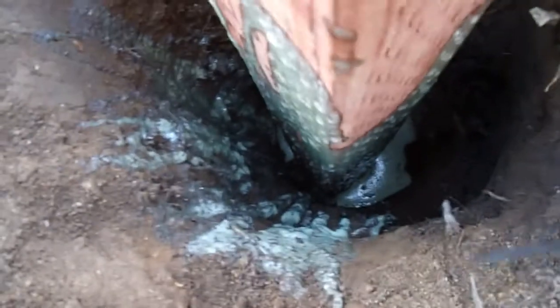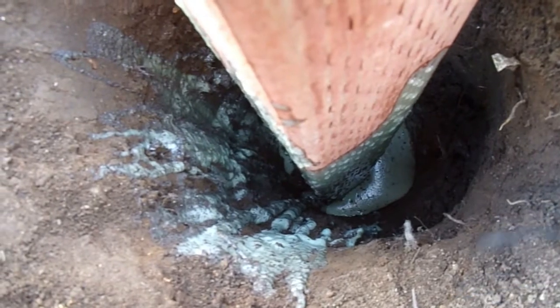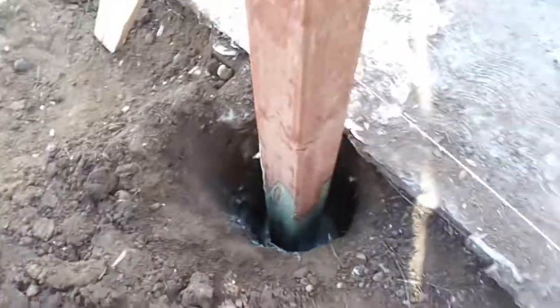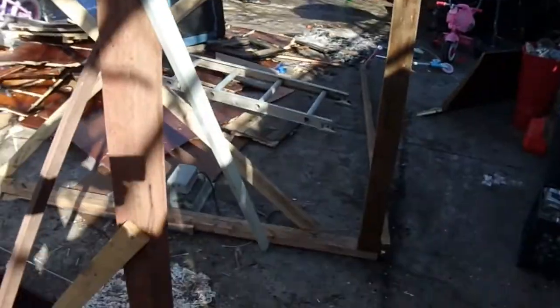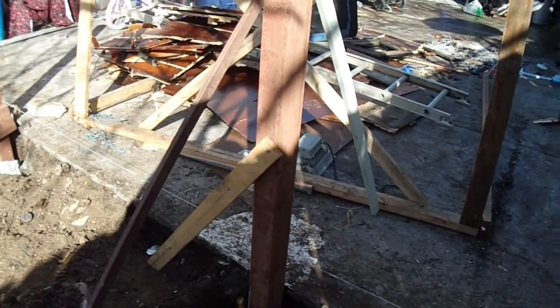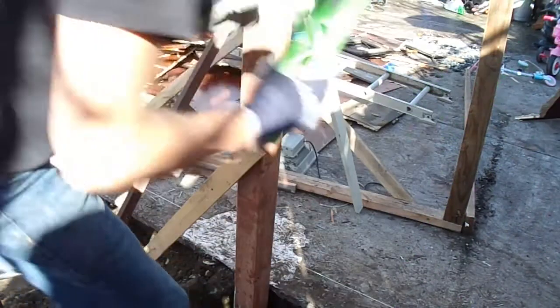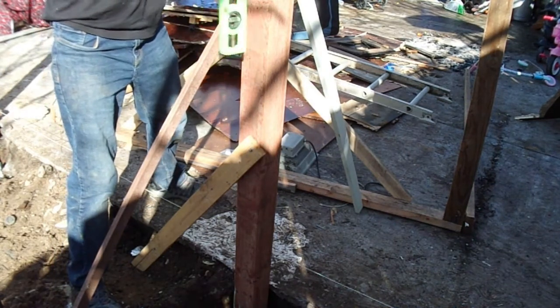It's kind of a greenish slime — it looks like green slime. Immediately, within about three minutes it's actually setting, and within two hours it's set enough that you can actually build the fence. That's why I chose this product — I didn't want to have to wait until the next day like with concrete. I wanted to start putting up the fence right away.